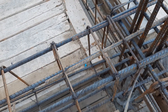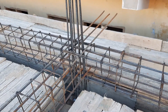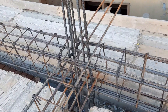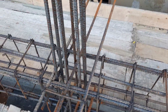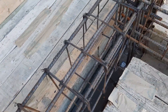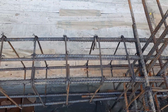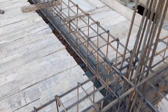If you are working on site, be careful — especially regarding technical requirements, which are critical in construction. Look ahead: everything is in front of you, and this is a four-story commercial building. Lapping is not allowed at the distance of L/4. If lapping is required, you need to find the proper location from the structural drawing. Hope this short video can help you. Thanks for watching — see you in the next video. Goodbye.